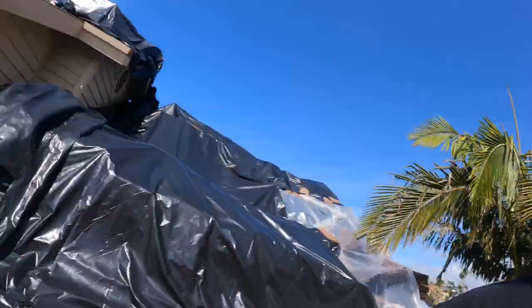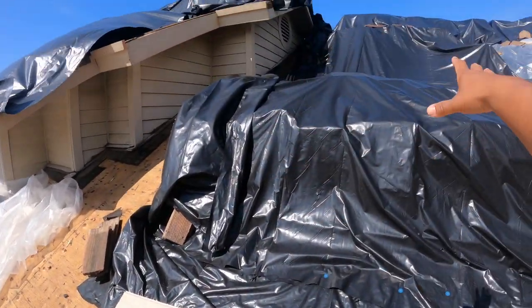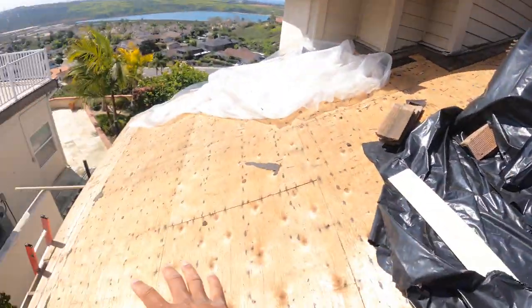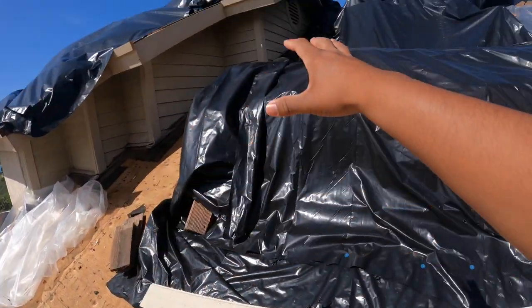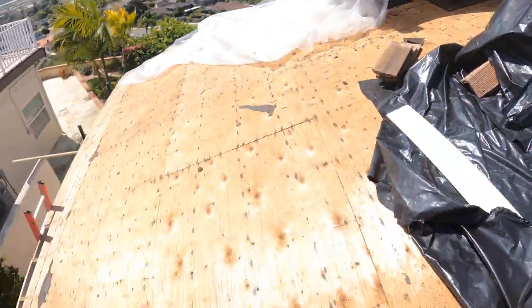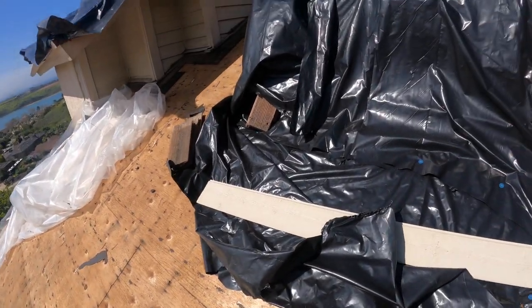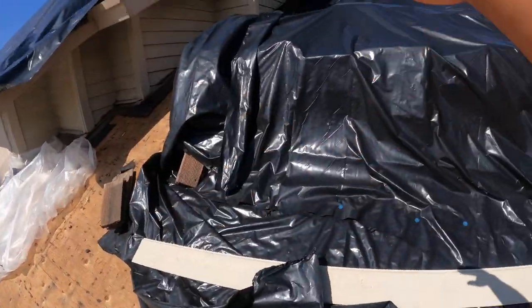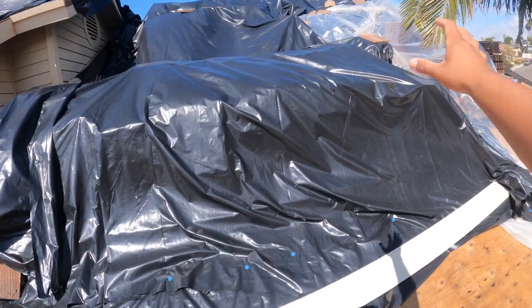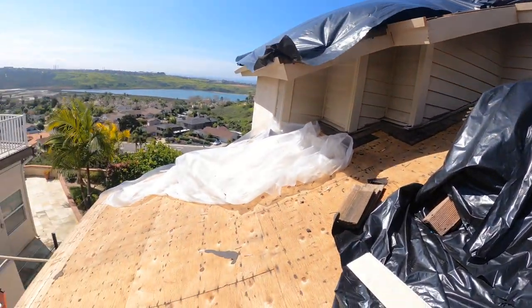complicated, a lot of labor, because everything has to get taken off, walk to the top, take off, walk, take off, walk. So this tile right here in the middle is from this section right here, and that tile up there is from half of this up. So half the roof up there, this bottom half goes here. So when they put felt and start throwing the lines, this all goes down here. And every time they go up, it's a section that's cleared enough where they can move the tile and put felt at the same time, so nothing gets in their way. So everything gets done the right way and nothing's interfering where they have to do double work.